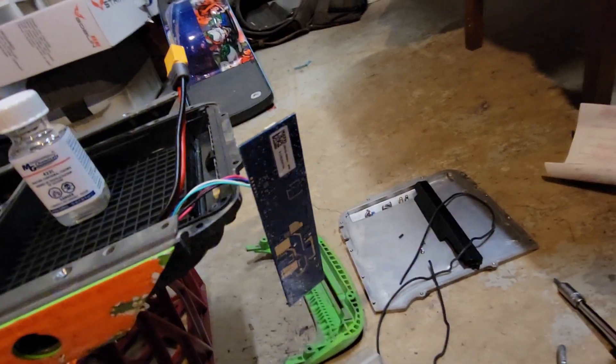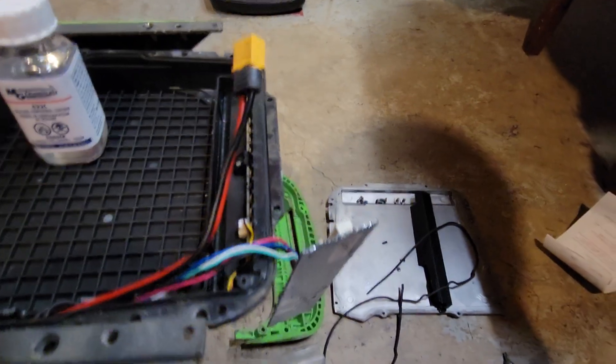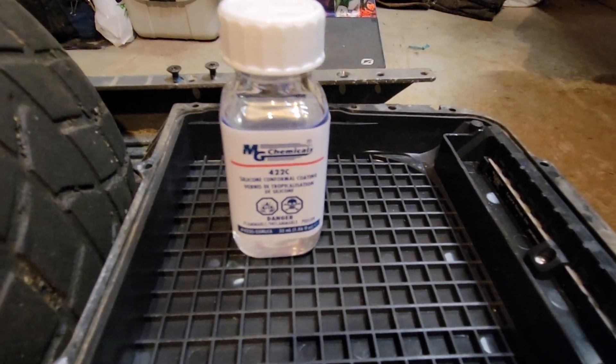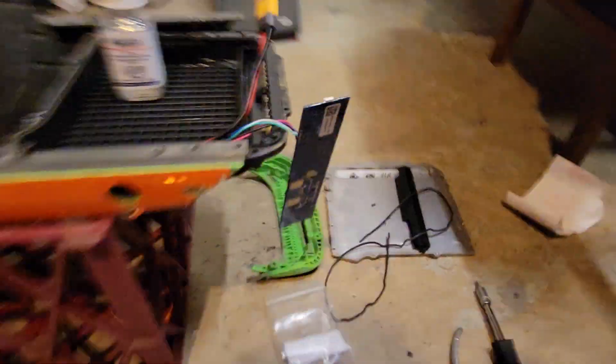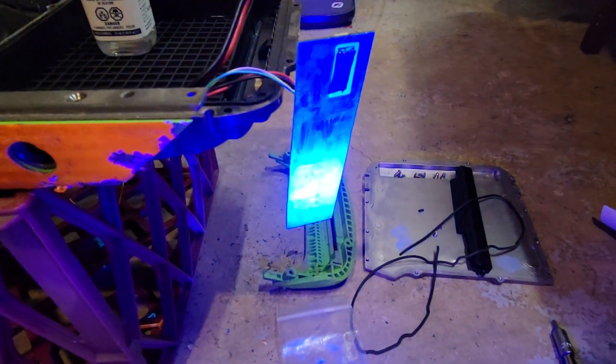Notice with the BMS, most of it was waterproofed but the edges weren't done and parts of the board weren't covered — not a huge ordeal. I ended up using this conformal coat from MG Chemicals; been using it on freestyle drones for a lot of years with good results. You can inspect it with a blue or black UV light.